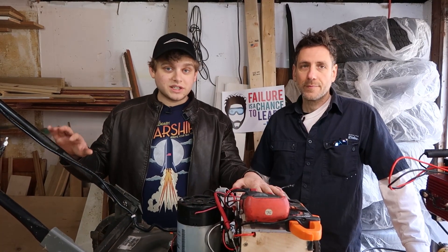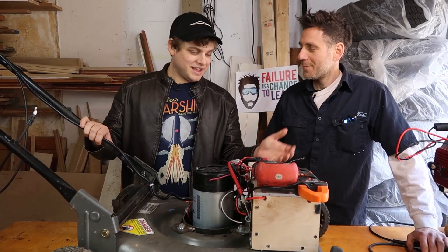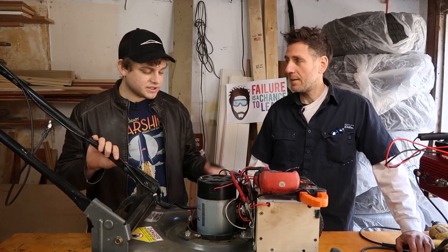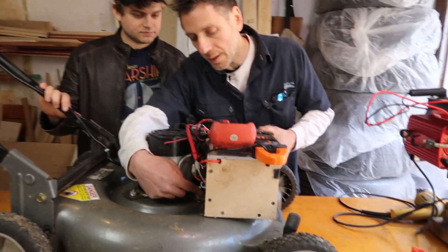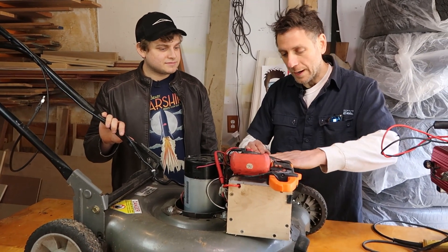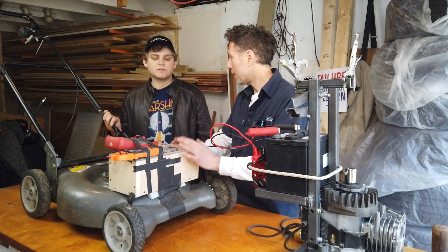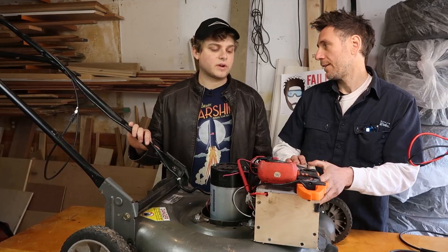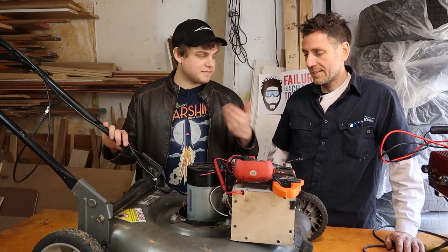What do you think we could improve upon? The box is great and it's strapped right onto the adapter with little L brackets. But the problem was I didn't know the temperature. I felt the top of the box was getting hot, which means down inside at the cell level it's definitely getting hot, and you want to monitor temperature. Next time either we have a box that breathes or we have a temperature sensor.